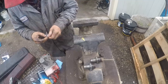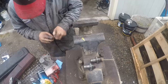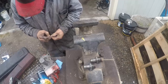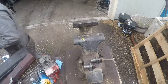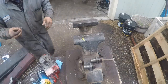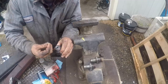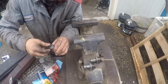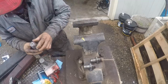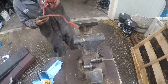So anyways, pulled the head off. Cylinder number 3 was completely embedded with metal, and cylinder 2 had a couple pieces of metal embedded in the piston. And long story short, pulled all the valves out of the head on cylinders 2 and 3. Didn't see any broken valve seats, no valves damaged. Was kind of scratching my head what was going on, so I decided to go back to the actual problem that I could physically see, which was the VGT turbo actuator arm being off.